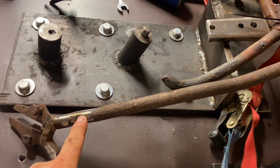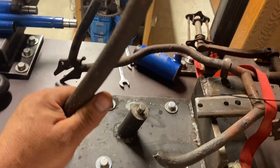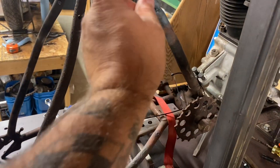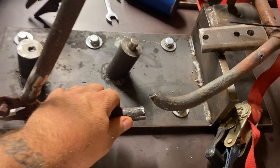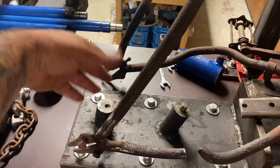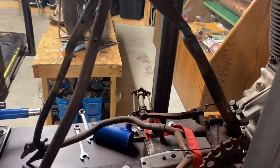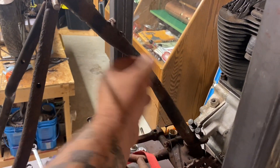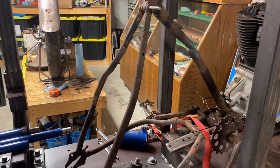One of the other things I did this week was I took this broken piece that I'd found in the farmyard and just welded it back in place - pretty crude, but whatever. Once I get this back tube straight and where I want it, I'll pull the motor out, bring this into the shop, straighten it out, and weld it back together just so it's together for measurement's sake. Then we can start figuring out the alignment on the back - how much width we need. It's all critical because it all ties together in a triangle. When you pull this back it could move this way, and you have to account for how everything's tied together - pull it here, push there, and it affects the rest of the geometry of the frame.